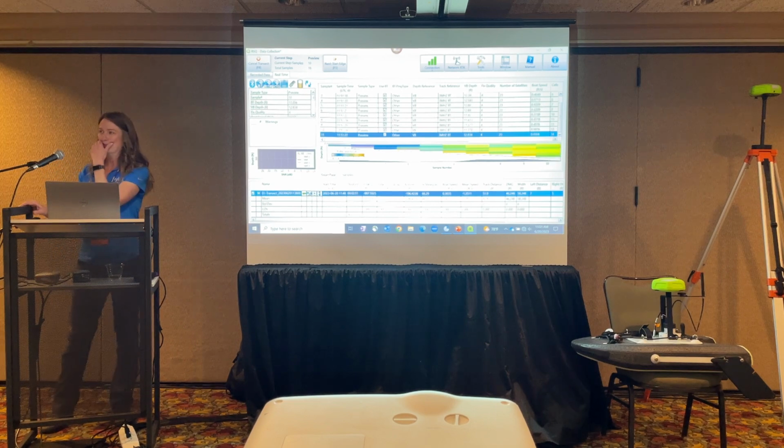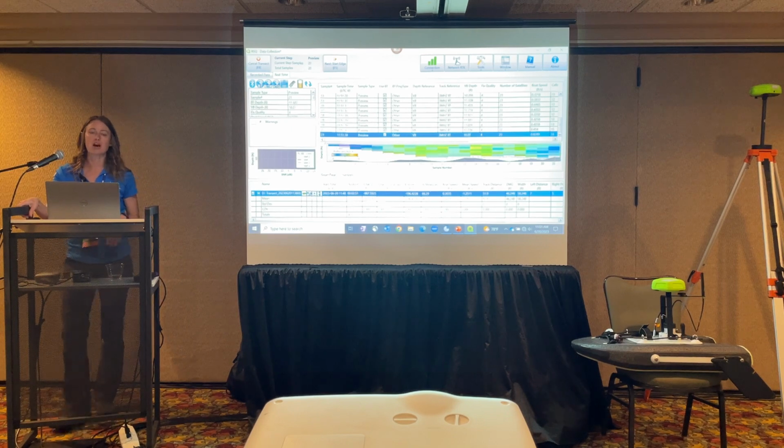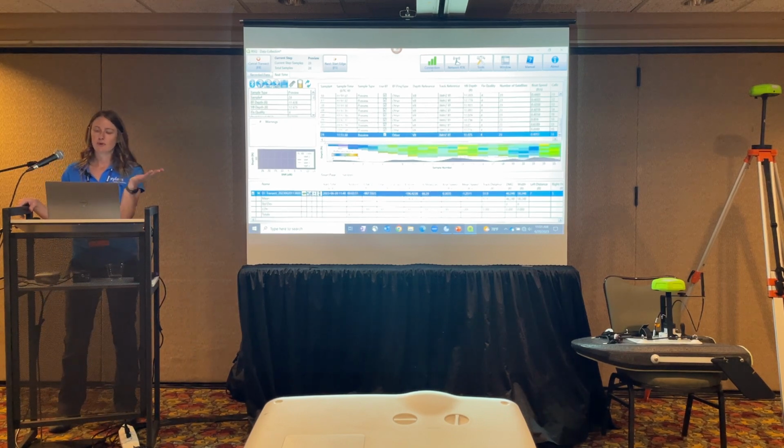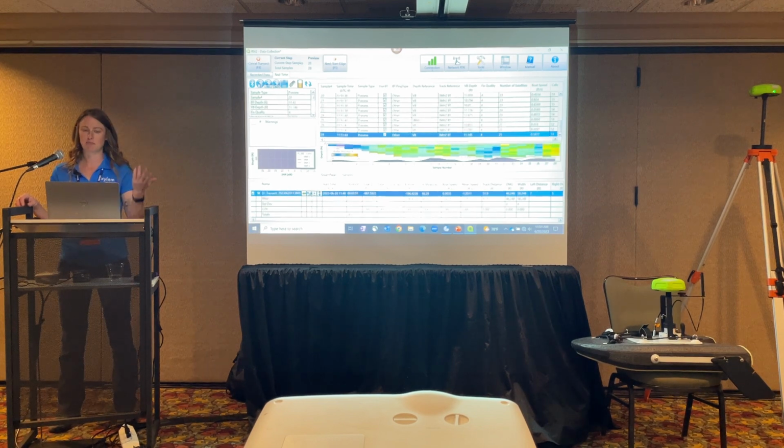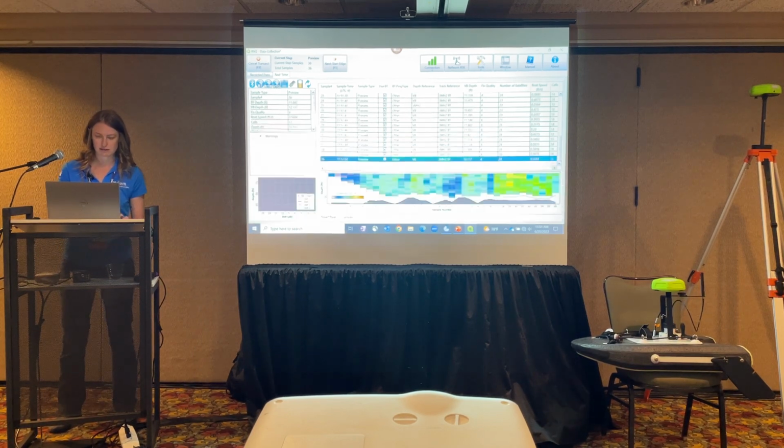That edge of water is the area where you can't measure because it's too shallow. So you're getting as close to it as you possibly can before you lose cells. So when I got out of that edge dialog box, it finished up the 10 samples at that edge, and then it ended that transect. So now I'm back in this preview mode. So I can tell I'm in preview mode because of this.